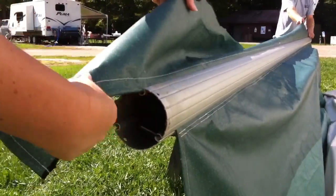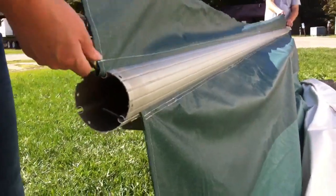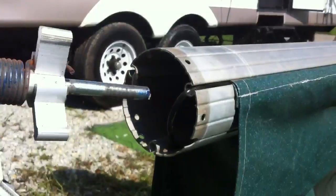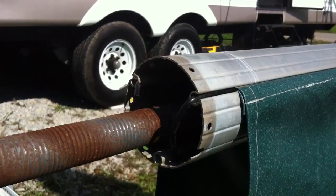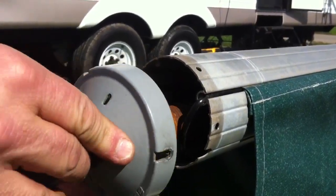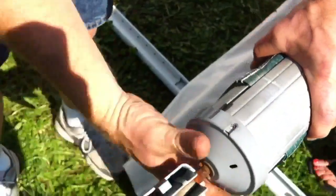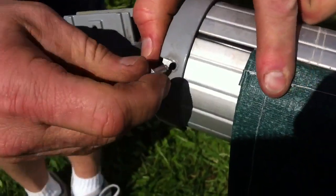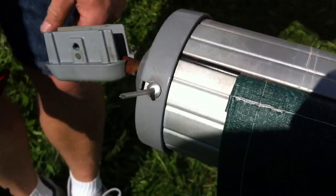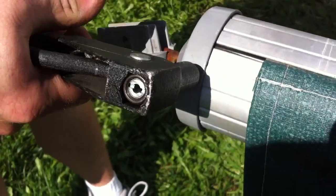Once you get your valance centered on the main tube, you want to lock the poly cords in — this keeps the valance in place. Next step is to put the torsion assembly in. Once we get it slid all the way in, we're going to make sure the marks that we made are lined up. Turn it until that matches right up, then simply rivet the three holes that we drilled out before, and that'll hold the torsion assembly in place.